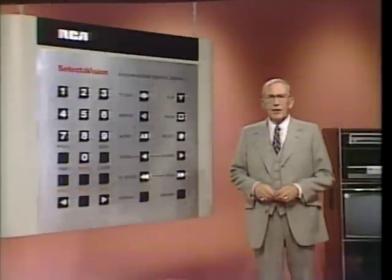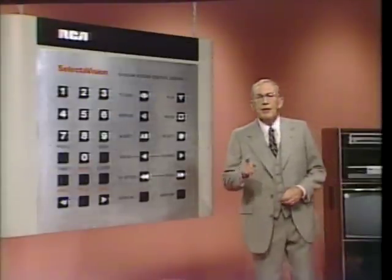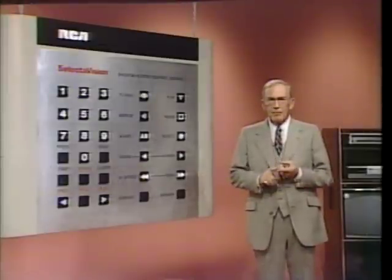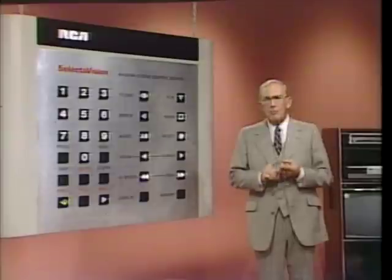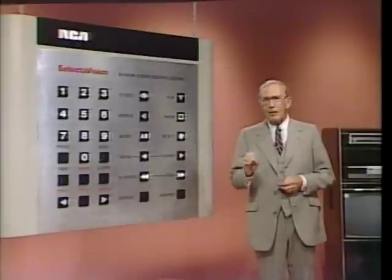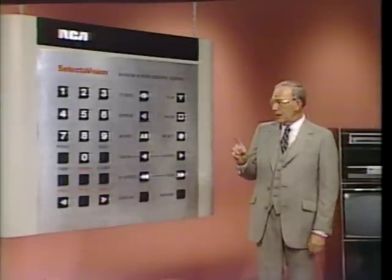Let's review the SJT-400 random access features and functions. There are five basic random access modes of operation: start time, program time, start band, program band, and page access. Start time access lets you select any time to the minute and second to automatically begin playback to the end of the disc side. Now, find the time key.